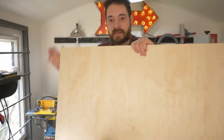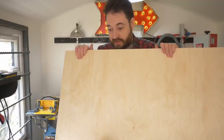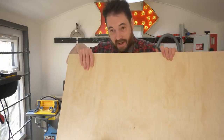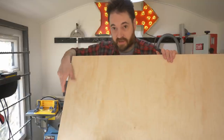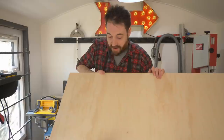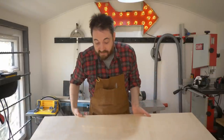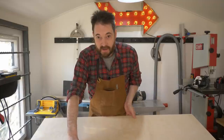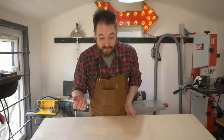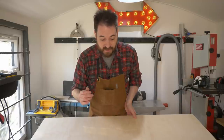What I've got for this is some 12mm birch ply. I wanted a good quality ply because it's nice and strong and flat. I got this on eBay — four foot by two foot — and got it delivered at that size. More expensive to do it that way but I didn't want a whole sheet. The reason I went for 12mm is because the thicker the base of the sled reduces the depth of cut you can get, so I think 12mm will be perfect for this saw.